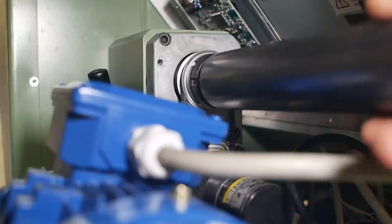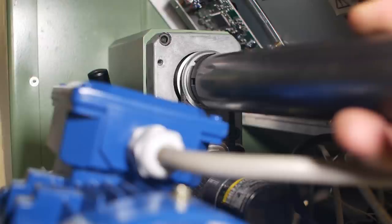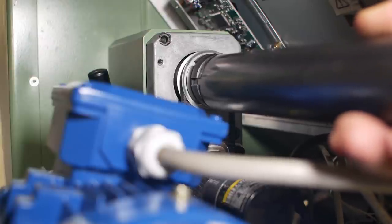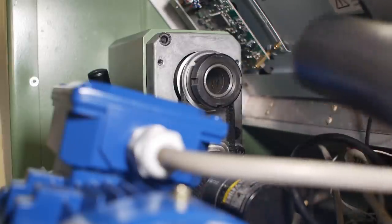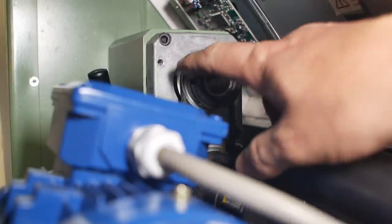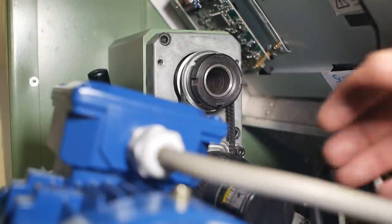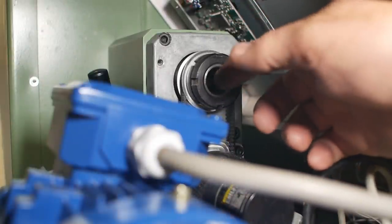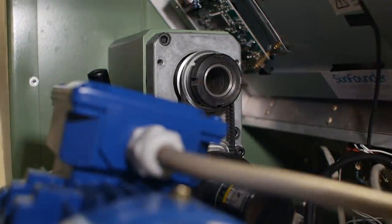Now I'm going to need a tube slightly bigger than the OD of this pipe. Due to lockdown, I'm not going to be able to go and buy a piece of pipe next week, I'd say. So I think I'll just make this out of sheet metal. I'll use this as a mandrel, bend some sheet metal over it so that it clears the outside of those nuts. And I think I'll also give it a bit of a funnel shape so that the swarf naturally comes back and drops out. At least that's what I hope is going to work.